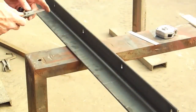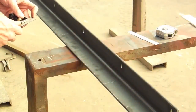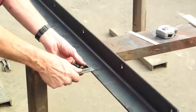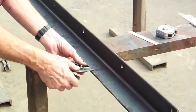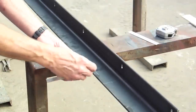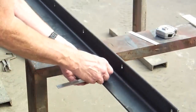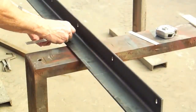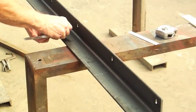And a cross slide is 3/4 by 3/8 deep. So let's cut out a 1/2 inch of material. That will give us plenty, so the cross slide does not get in its way.